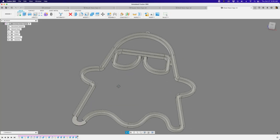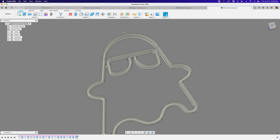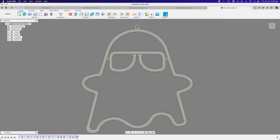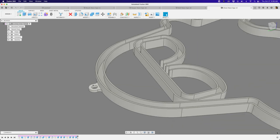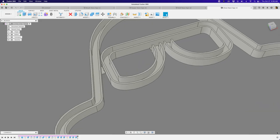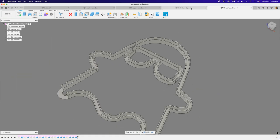First I want to show you some things to consider when making your signs. The point of this one was to make two separate LED strips that have individual animations, and one thing I found is it's very difficult to get the NeoPixel strip to fit into very tight corners. Having really big corners and curvy shapes works best. Another thing is to have an integrated loop for a hook so you can hang it, and also adding support structures to the individual elements.